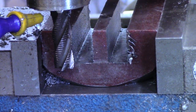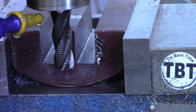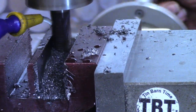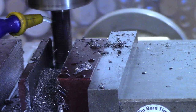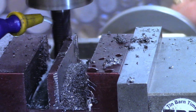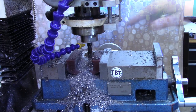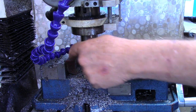I've got both sides to depth now. I'm going to see if I can take this center out, maybe in two passes. We'll leave it at full depth. I do love using these roughing end mills for jobs like this. I'm going to get a few of the chips cleaned up and replace the roughing end mill with a finishing end mill, then come back and clean up the edges.